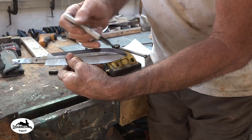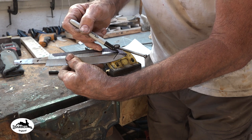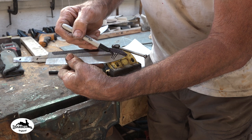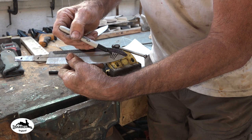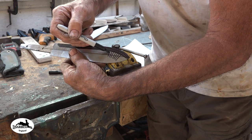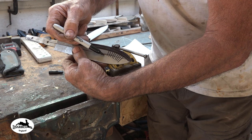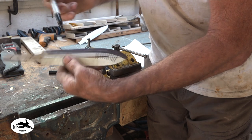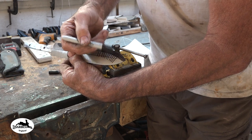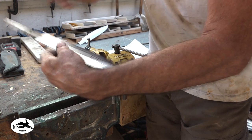As I grind these now I want to take into account that curvature. What I'm going to do is file on an angle like that, so they follow that edge there, and then as we come onto this straight part they will all kind of flow that way. So that's how I'm going to do it. I'm not simply going to go across the blade — I'm just going to follow that edge at 90 degrees the best I can.